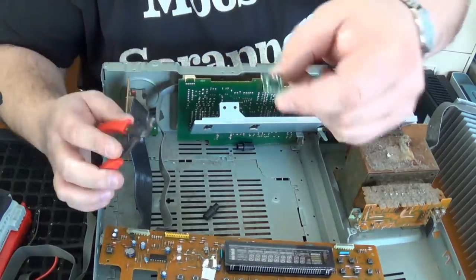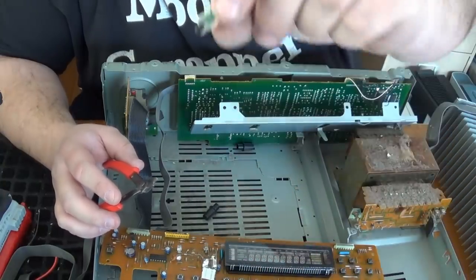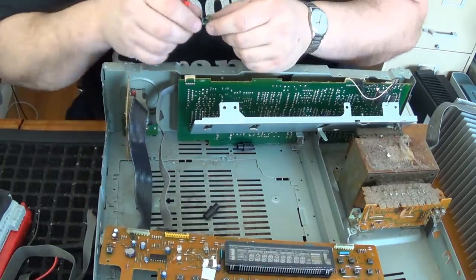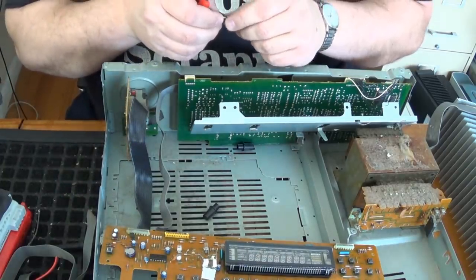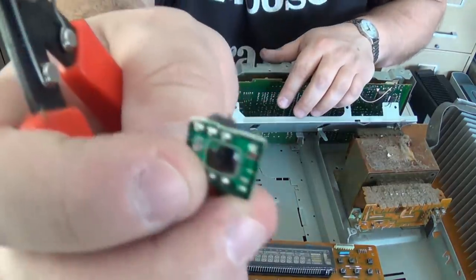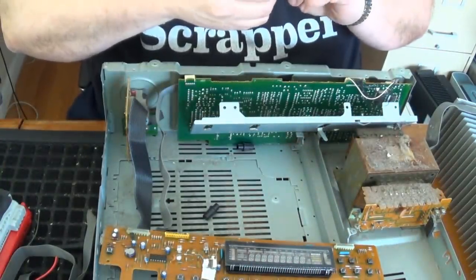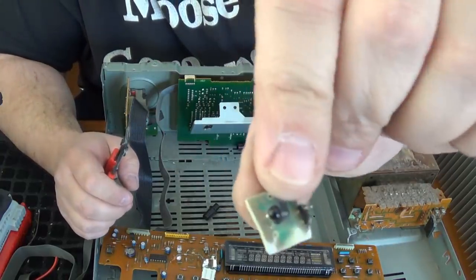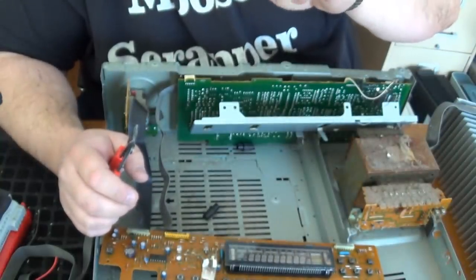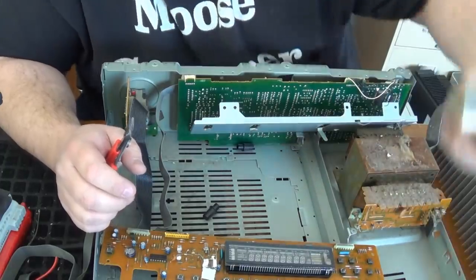So this is the remote control sensor. It's got a little black glob on the front, which likely has some bonding wires underneath it — hopefully they're gold. I can see a little bit of gold plating underneath the solder mask. And there's also one tiny little MLCC in the corner. As for this thing right here, which I assume is what picks up the remote signal, I'm not sure if there's anything in that — counting on you viewers if you have more experience.